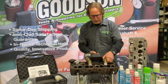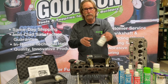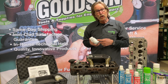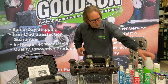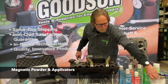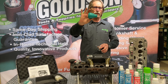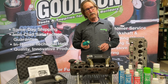Before we can use this magnet, we have to determine what type of powder we're going to use. We offer dry mag powder in a variety of different colors — white, yellow, and red — in one-pound, five-pound, and even 25-pound containers. We've got to get that powder out of the container and onto the workpiece. We've got a couple of different ways to do that: this nice little spray bulb — we've had this in the product line for probably 25 years. It's quick, it's fast, and you can sprinkle that powder quite easily.